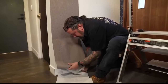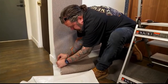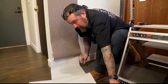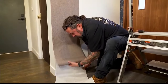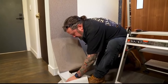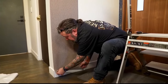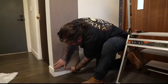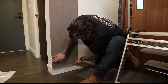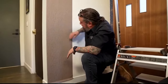I'm going to make this a little easier — I'm going to come down here below my base trim and just give myself a nice rough cut. I like these single edge blades for this. Just get this out of the way for now. So now I can come down here and pull the rest of this backing paper off — we're not chasing that around. That gives us a good chance to come in here and keep working this down. Now this is that time that we want to go through and take a look and make sure we don't have any bubbles, and that we're really happy with the way this is laying.